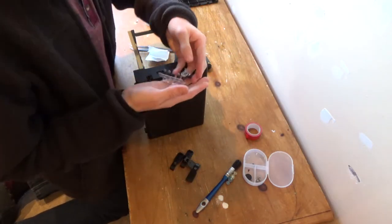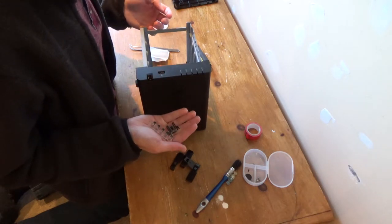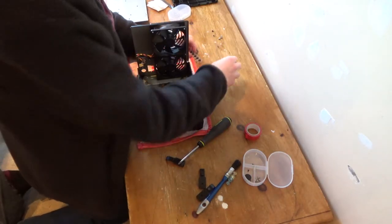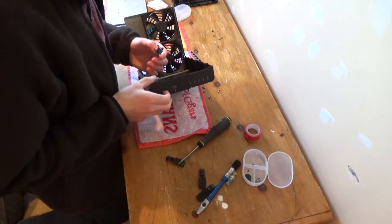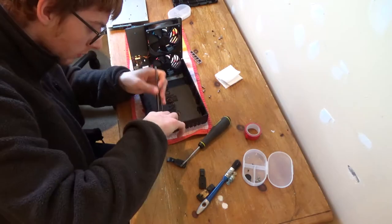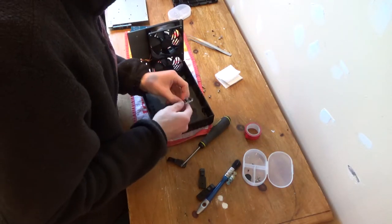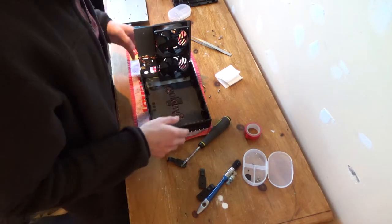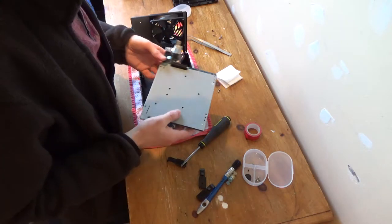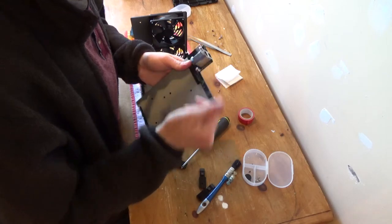I don't believe it — I haven't put the button or LEDs back in, which means I need to dismantle it all to put these back in and then reassemble it all. I'm not going to record that because it will take ages, so I'll just jump to when I've put these back in. I've taken it apart again and now I'm putting the button and the LED lights in, which is what I missed before. Looking back, I'm pleased I did take it apart again because I noticed I actually missed a step — I need to tape this foil back onto the case so it's grounded, because it's not sticky anymore.